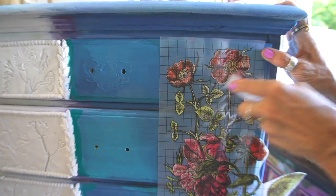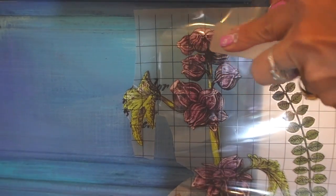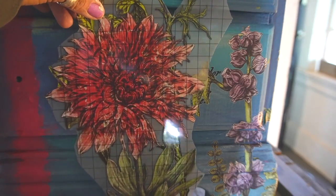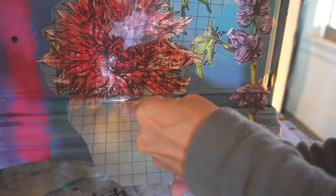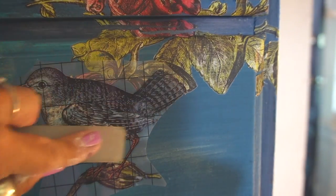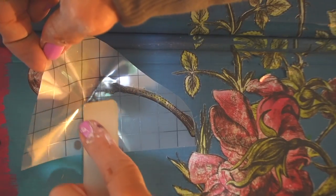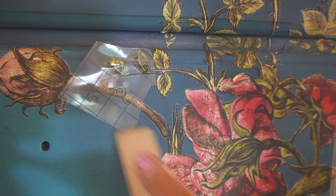I was so frustrated I wanted to cry and scream because I had been waiting to learn how to do this, and I was the only one who wasn't doing it. Your surface needs to be optimal for the blending situation. If you are familiar with furniture transfers, you've probably heard it's best practice to apply a sealer over the paint and let that dry before rubbing on the transfer — otherwise the paint can come up and stick to the back of the transfer. However, if you let the paint sit for 24 hours before rubbing on a transfer, most of the time it will go on without a hitch. DIY paint adheres really well because it's mostly clay, but you can still reactivate it with water if you haven't sealed it.